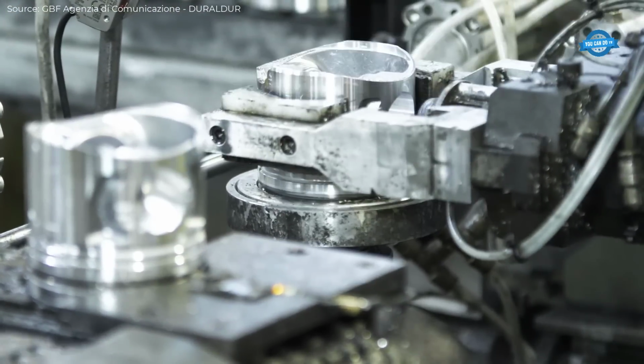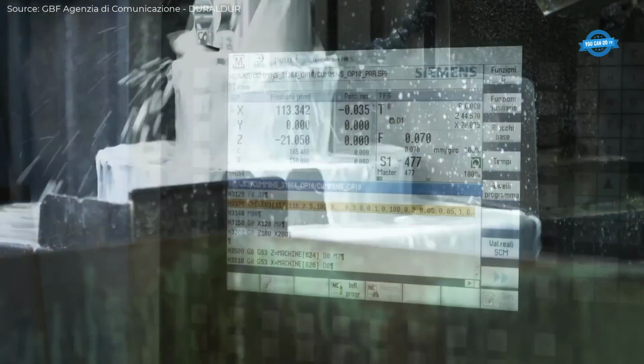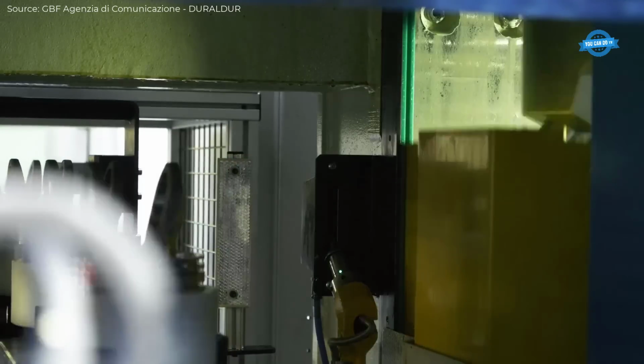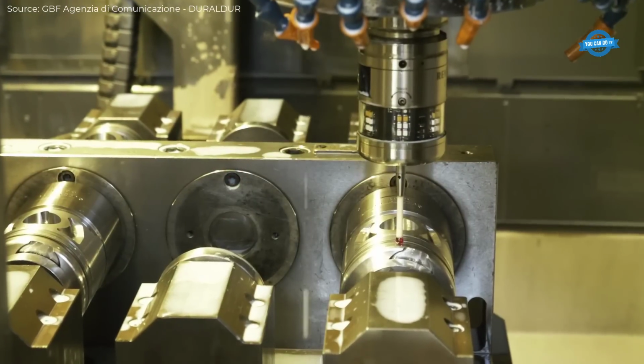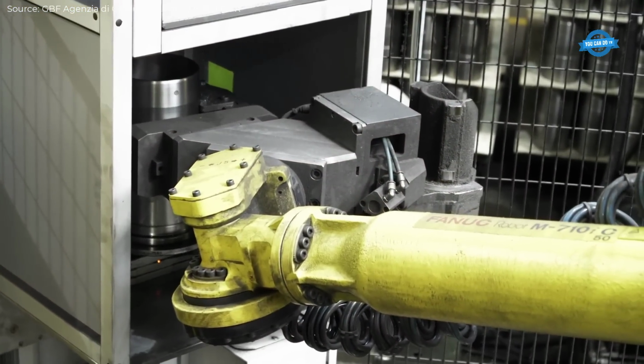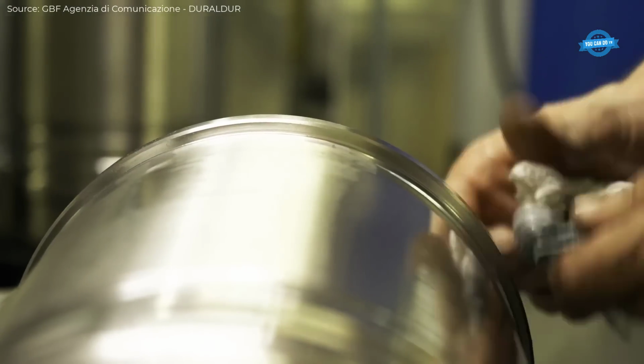Forged pistons allow for thinner yet stronger sections, which reduces overall weight, crucial for performance applications. To combat wear, particularly in the first groove, hard anodizing coatings can be applied. Additionally, graphite-based coatings are often used on forged pistons to minimize friction between the piston and the cylinder, further improving performance and longevity.